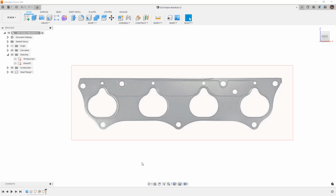But I plan to talk about each of those along the way, maybe the benefits, the pros and cons. Obviously some of it's going to be bling factor, but there are benefits to doing things like a full CNC built intake, because you can put dividers and runners on the inside to help direct the flow. When we're talking about boosted applications, there are important considerations as well.